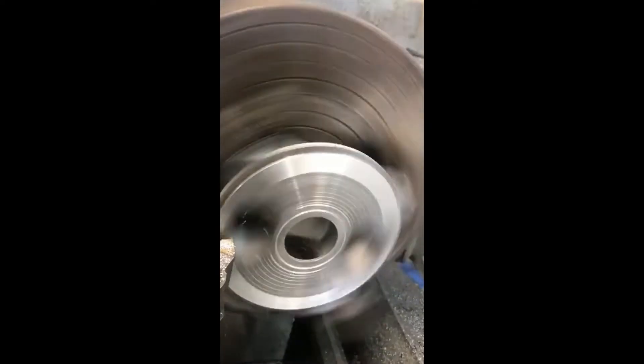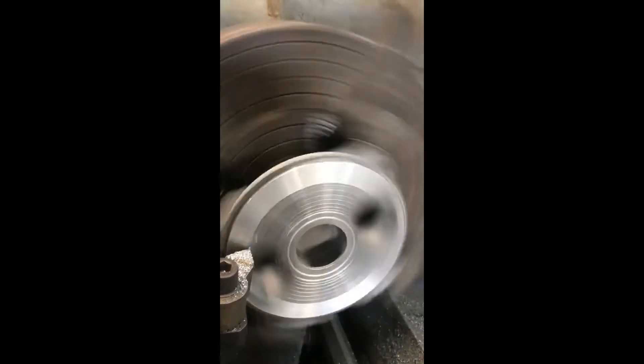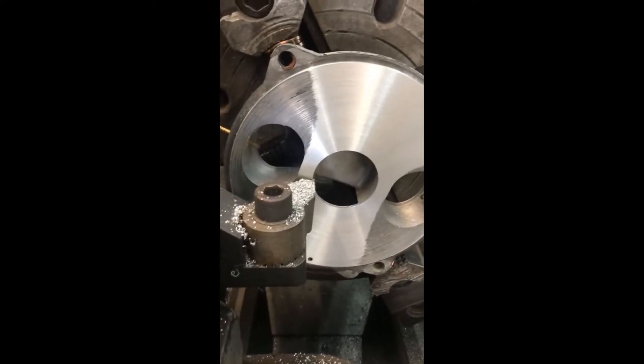I got my first cut going across here. I'm not going too fast — I'm not in a hurry, I don't have anybody telling me what to do. I'll speed it up on the next cut because on the first one we'll look at it when I'm done and you'll see where the low spots are and whether or not they're going to affect your valve. You don't have to be perfect, just gotta be close.